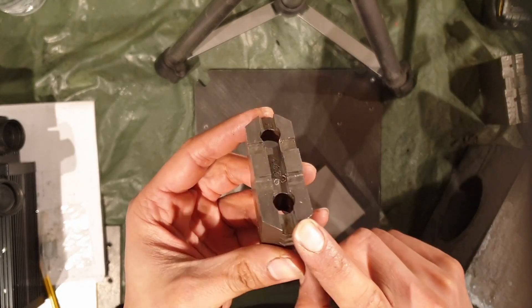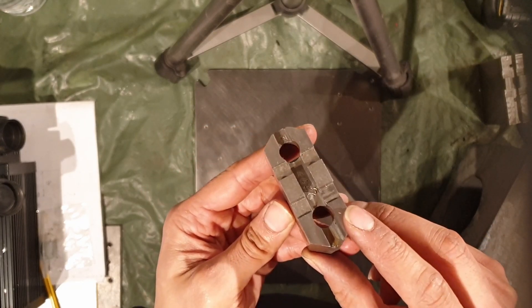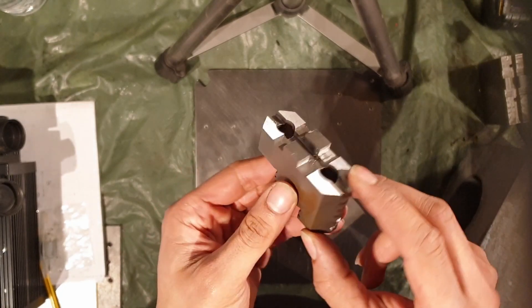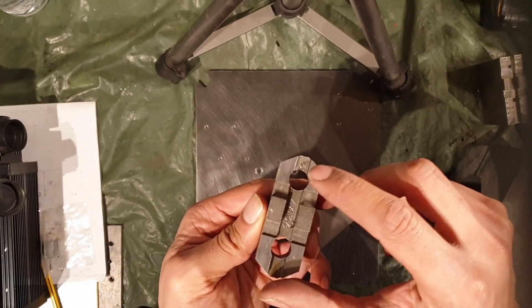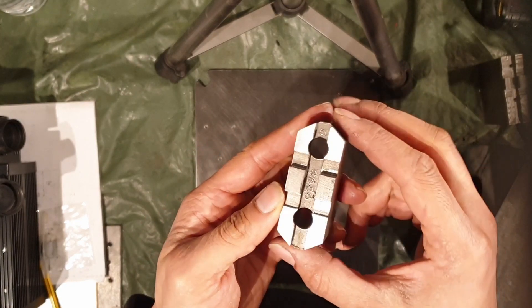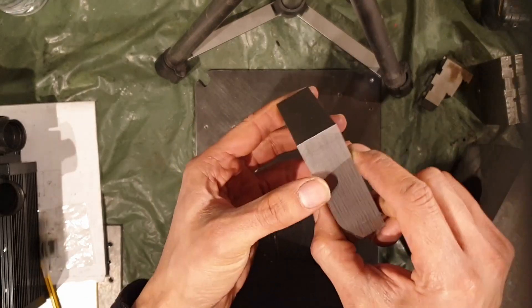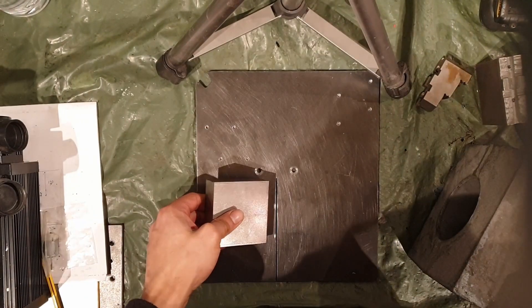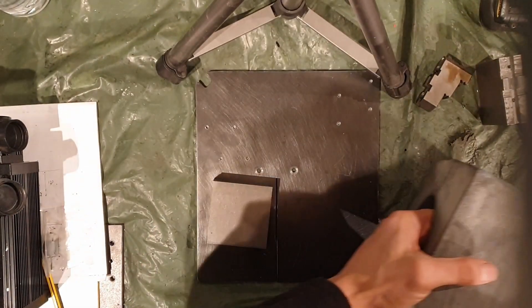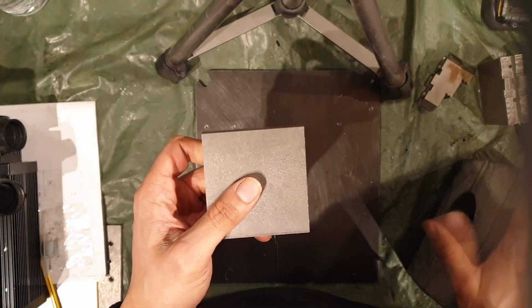That's going to be a bit of an issue with my 2.2 kilowatt spindle which spins very, very quickly, and my questionable setup. There's not a lot of material to take off - it just needs a slot mill through there, take off some there, and bring all of this material away. The intention is to get my soft jaws, mount this big bracket onto the lathe, machine these up on the lathe to get my final profile, and then machine the bracket.